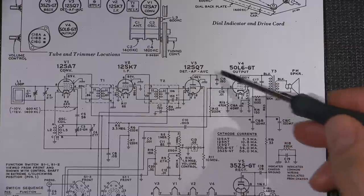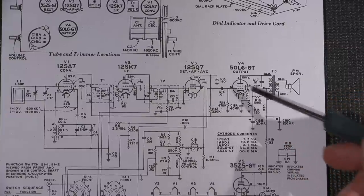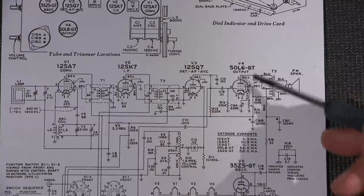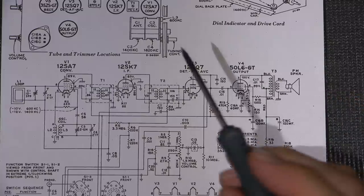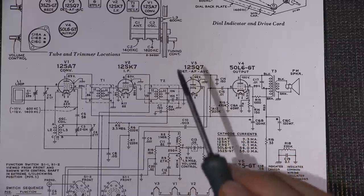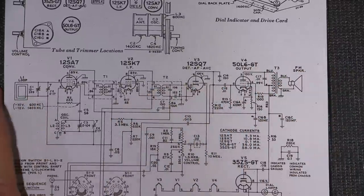Now, since this is driving, because of that leakage resistance across that capacitor, since it's driving this stage into such heavy Class A, a lot of times it tends to make the amplifier sound very nice. Here's the key: for a very short period of time before it burns the tube or the audio transformer out. Everything is in a balance. So, too heavy into Class A and you're coming out of that balance point. And there is your capacitor knowledge.